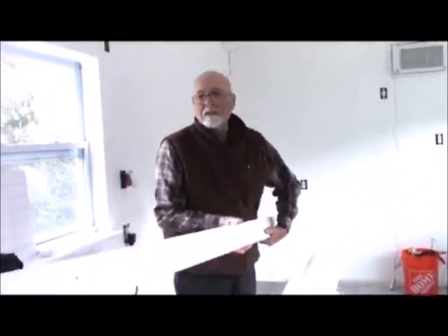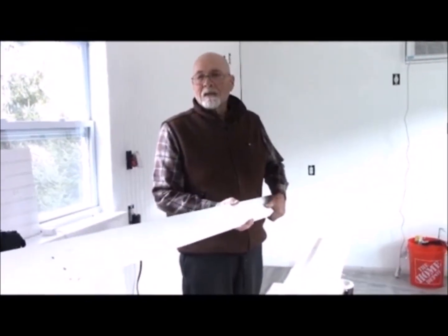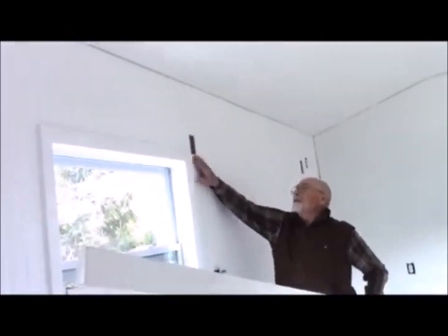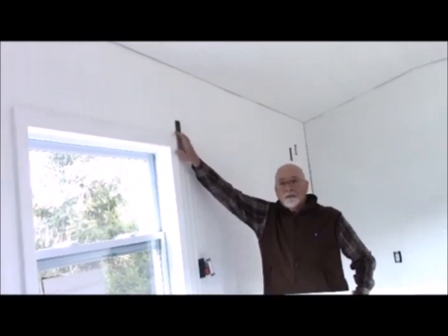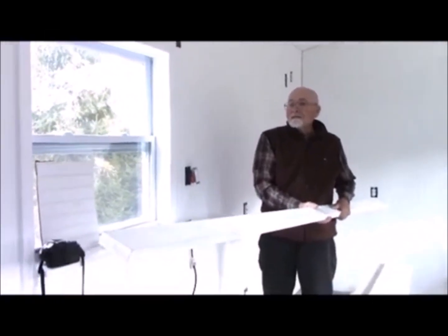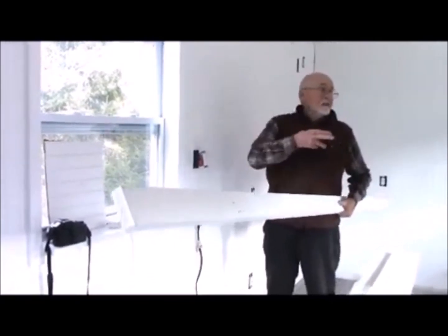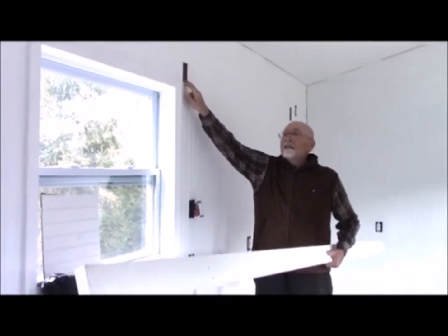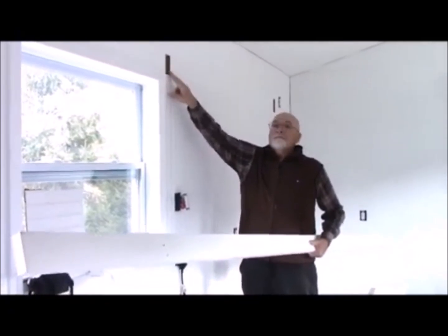We're getting ready to put up the final installation of the overhead system for our lighting and cameras. As you recall, before we put up the siding on the wall, we put some bracing in here so that it would support the overhead rack, and then we cut out the spaces where they go. The long pieces here are about 3 inches longer than the distance between the 2 walls. So they'll go into the hole on each side about 1.5 inches, and then we'll fasten them in permanently.